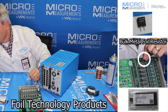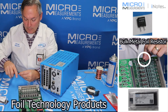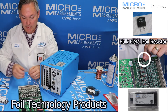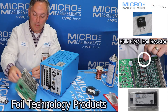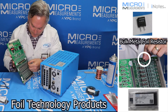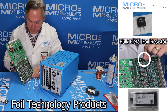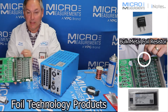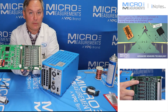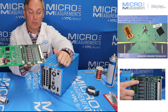In order to do that, I'll take my diagonal cutters and just trim them shorter — it's really that simple, that easy. I'll take the board, turn it around so you can see it, and then push these into the dry sockets just like that. And that's the only modification that you have to do in order to get this unit to be able to balance against a 5,000 ohm quarter bridge strain gauge.